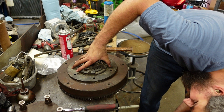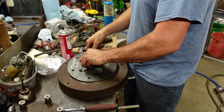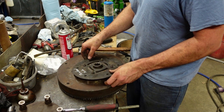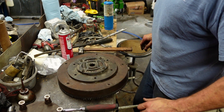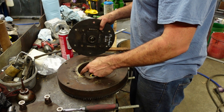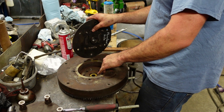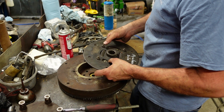The nuts holding this together are very tight on this — doesn't quite slide in there like you'd like. Looking at this, that's literally these nuts here that leaves us lined up almost perfect really. Maybe while I'm on the mill, I can nick in four spots just to make clearance for these nuts. I think that'll work just fine — I don't need to bore this and lose weight, but I could just take a little notch on each of these, just enough to fit these nuts in.